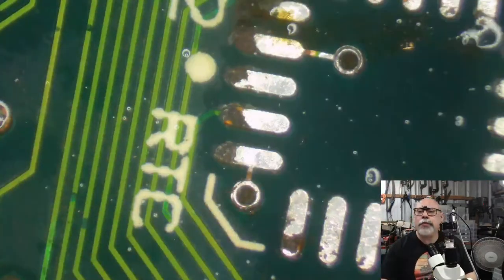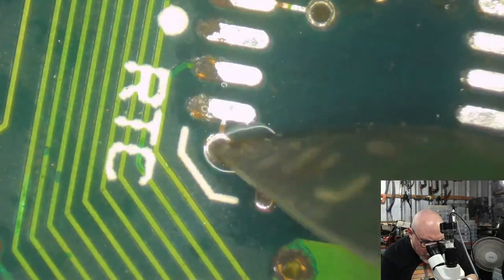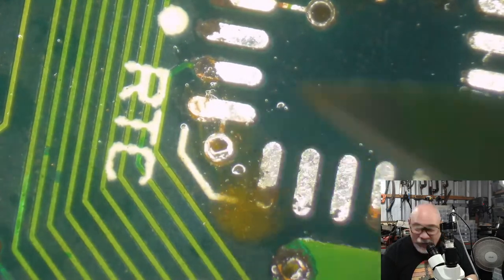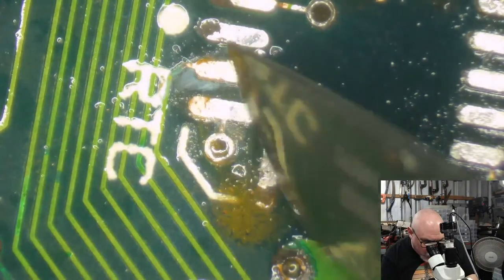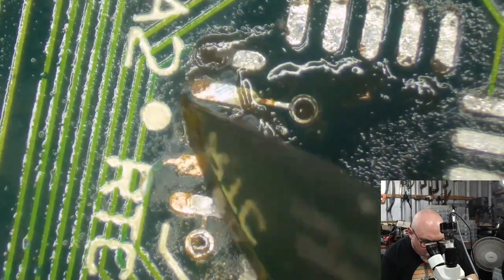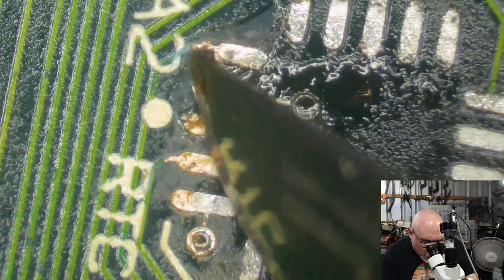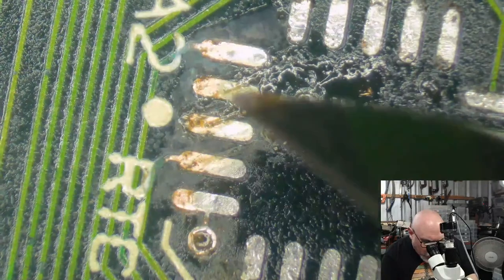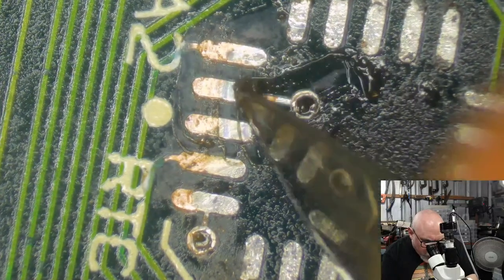It's interesting. I saw on one of the Facebook posts today someone who has made 1 megabyte RAM SIM kits for 30 pin RAM kits. And when it's a kit, it's not really a kit. It's a board, basically. He has created 30 pin RAM SIM printed circuit boards, and he then tells you which chips to buy. And they're through hole, not surface mount. So, you know, the RAM SIMs are going to end up looking a little bit clunky. But he has basically made these.